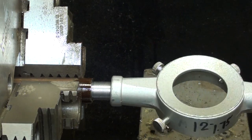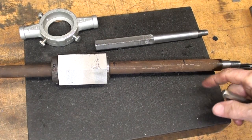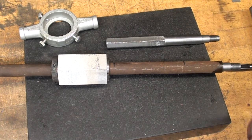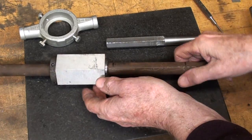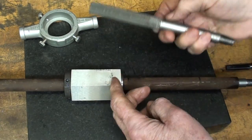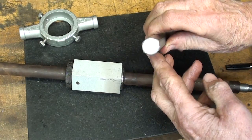Let's see if it fits. Pretty good. I've determined from my sketch and the prototype handle that I want the hexagon to be cut between this mark and this mark. I want the hex to be a little longer than what I need, because it will be trimmed on this end, and the taper will come into it on the other end. I've already mounted and tightened down the three-quarter collet held in the hexagon collet block. Most of you have one of these or at least a square one. So for indexing and producing this hexagon, all I'm going to do is mill one side, rotate it, mill the other — times six — and I'll have a hexagon.